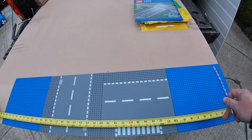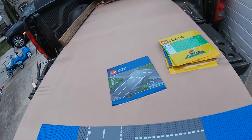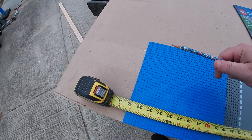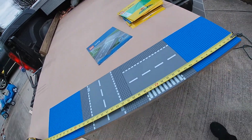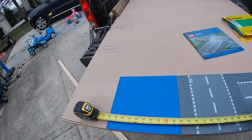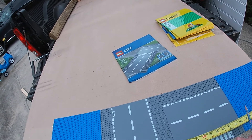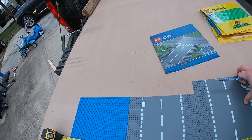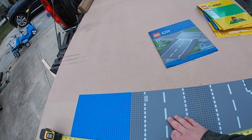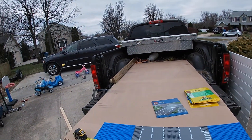We're working on the Lego table and I wanted to — these squares were supposed to be 10 by 10, so I wanted to lay them out just in case. If it's 10 by 10, that means it'd be 40, so cut it 40 by 40 and I'm good to go. But it looks like we're at 40 and an eighth. I'm glad I laid these out — just want to make sure they're all snug together. We're at pretty much 40 and an eighth, maybe because these ones are a little bigger or not perfectly square. So we're going to cut this board 40 and an eighth by 40 and an eighth.